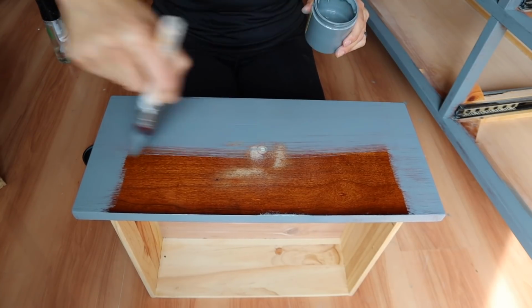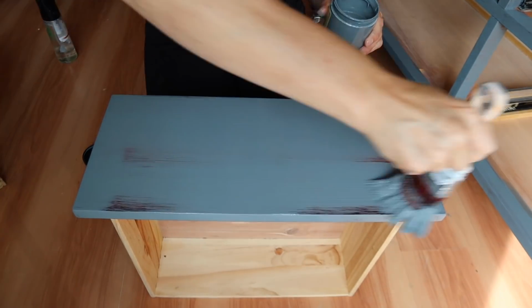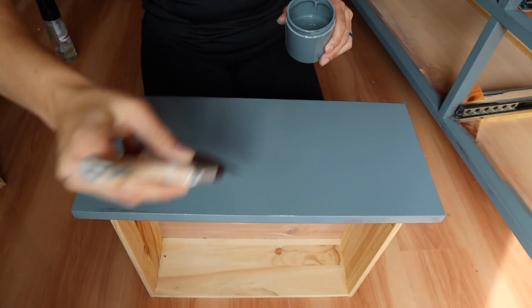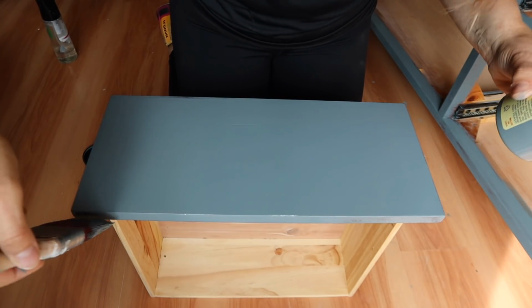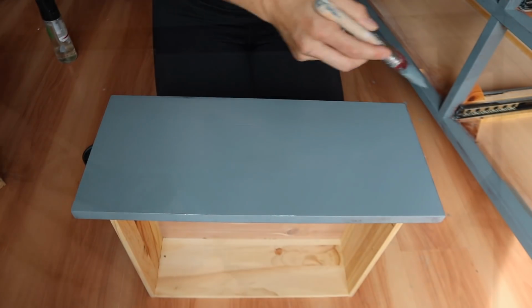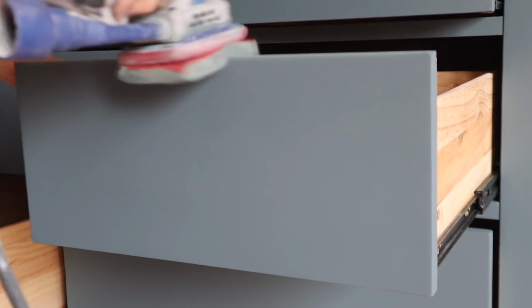And then I spray a little bit of water on the drawer front, and then I do long strokes with thin layers of paint, and then I go in the opposite direction. You can see the areas that don't have paint, and when I do that opposite direction, it covers those. So that's a good example of why I do that and how it takes even the little bit of paint that you already have and it covers some of those areas that didn't have paint on it.